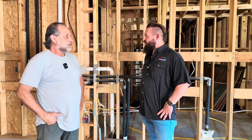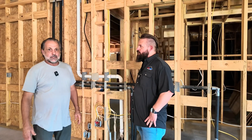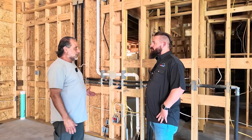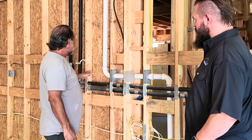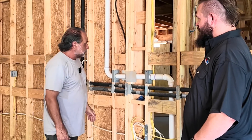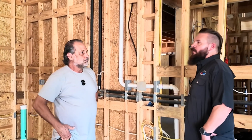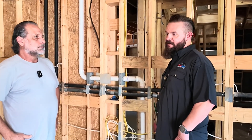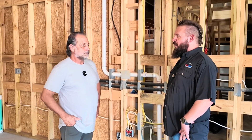Are you going to use some spray foam to seal off the garage area? I've sealed everything as well as I can, but I've got an attached garage — an 18-foot by 9-foot garage door. Everything's going to come through there. I've got ZIP on it and I'm going to try to put ZIP all the way around, but that still doesn't do anything with my garage door. So there are still a couple of penetrations to work through. You could leave that sliding window open and probably pass a code blower door score, but you're going for much higher than that. Even at the shape you're in you're probably going to achieve it, but you're still pushing forward to get it as tight as possible.